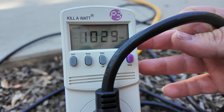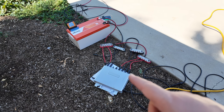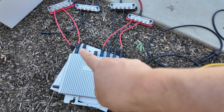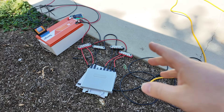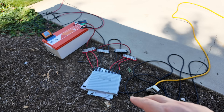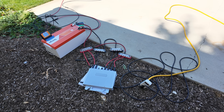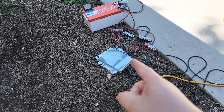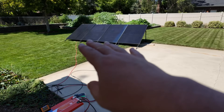We are getting 1040 watts of power produced by that microinverter — and we can see here on the app it's pretty close, around 1030 watts. The Utah law says we can connect up to 1200 watts of solar, but for some reason I'm only getting 1000, which might be because I've disconnected that port. In any case, let's say it sticks to 1000 — this will still be substantially better. We can't feed more than 1200 watts into the house, but there's no limit to how long you can feed that power in. If you're connecting directly to the solar panels, you're going to be producing power only when the sun is shining.